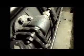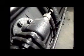Remember, the boiler can get up to 245 pounds. Let's say it's normally operating at 220 pounds. The force of the water going in has to be 221 pounds to get in. So that's how it gets in under pressure. The force of the water going in has to be more than the force of the pressure inside the boiler itself. I'm going to go on the other side now and get what we missed.